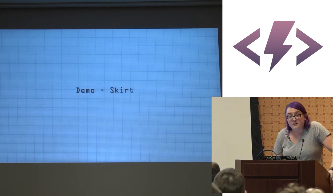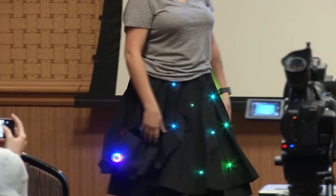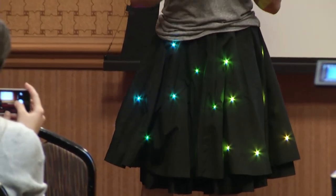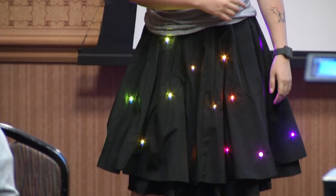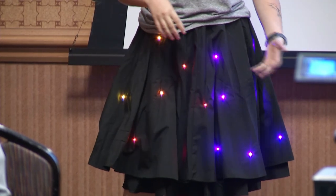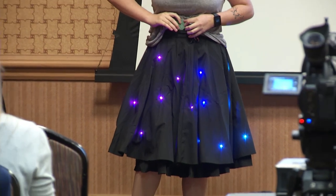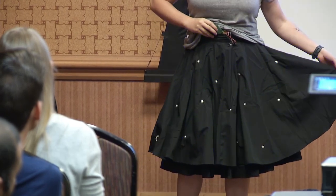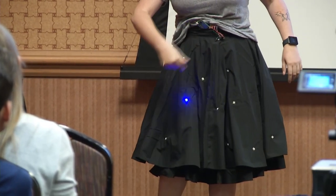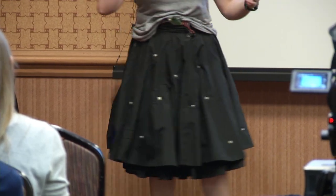The demo I have for the Espruino is actually the skirt I'm wearing, which is covered in 42 NeoPixels. It's running an HSV algorithm right now — cycling through all the hues at full saturation, so you get a rainbow. I can hit a button to cycle patterns: one randomly sets a blue value per pixel, and the last one runs a pixel around the skirt and back by setting an index to a specific pixel.